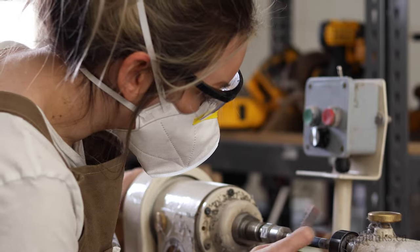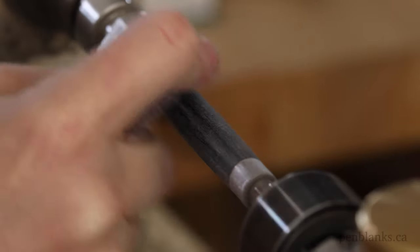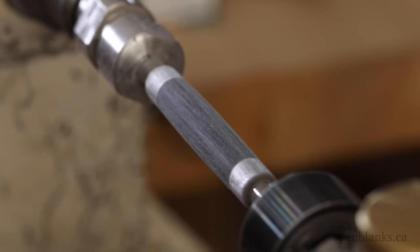The key to making it perfect is to take your time with each grit, stop and examine the blank. Clear off the dust with your fingers to check for any remaining scratches and buff them out. Repeat this step after each grit.